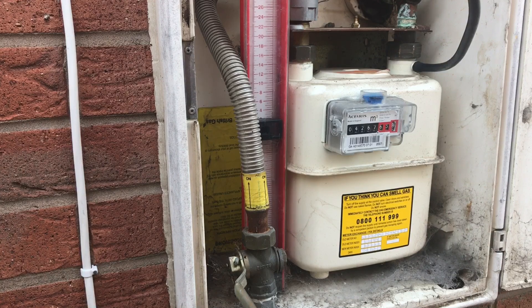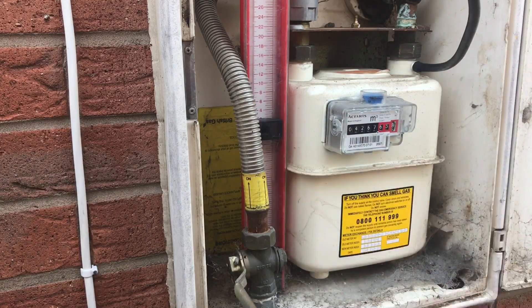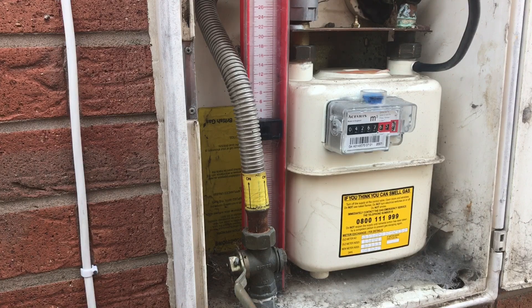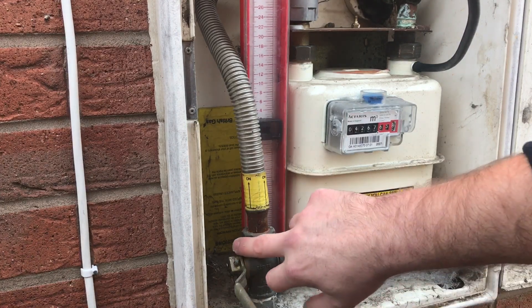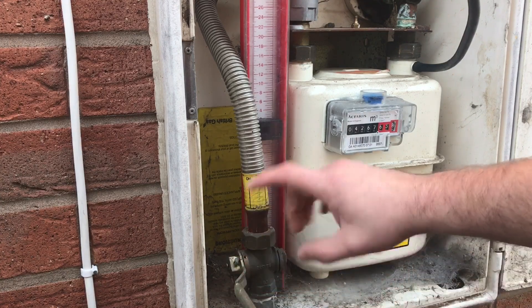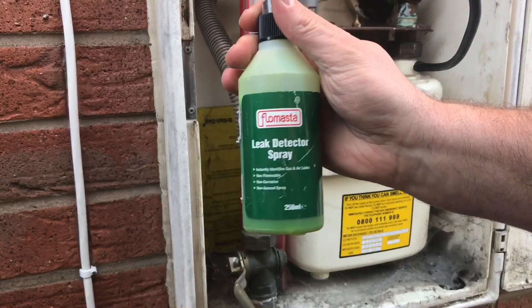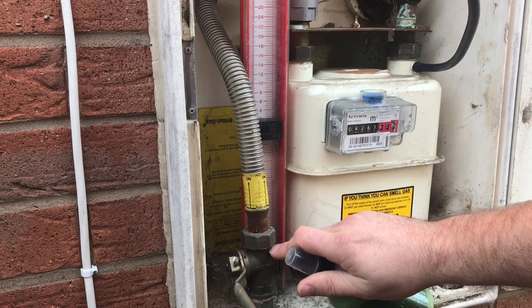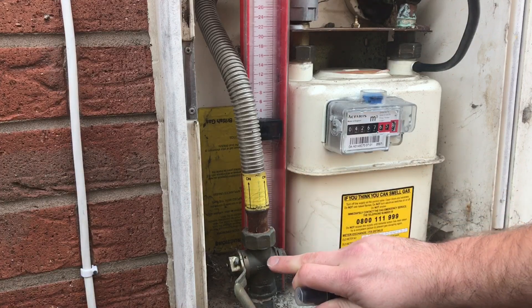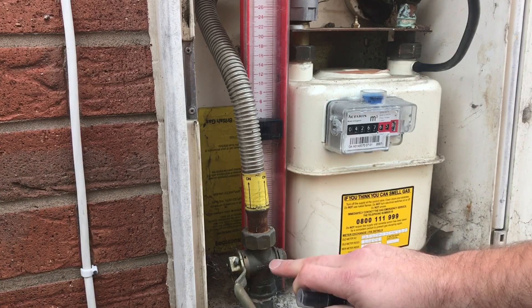NPM is an abbreviation you'll need to know. For a water gauge it's 0.25 millibar; for an electronic gauge it's 0.2 millibar, so it's more accurate. When a rise greater than NPM is recorded, the cause must be investigated and rectified. To check a let-by, disconnect the downstream outlet union, make sure the gas is off, and apply leak detector fluid to the ball valve inside to check for bubbles. If it is leaking, this is the gas board's job - immediately contact them and make it safe by putting a cap on.